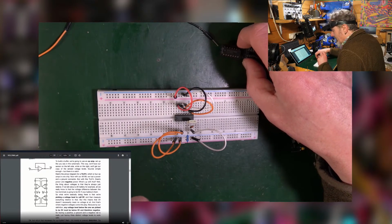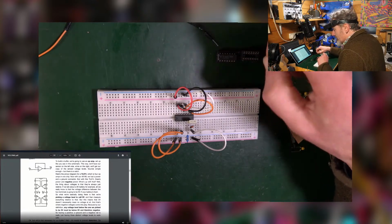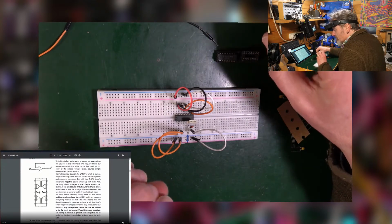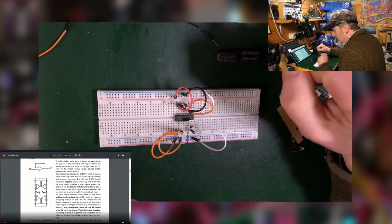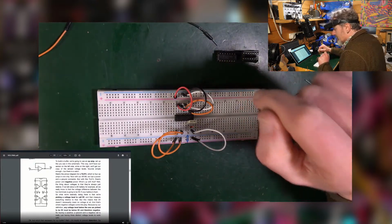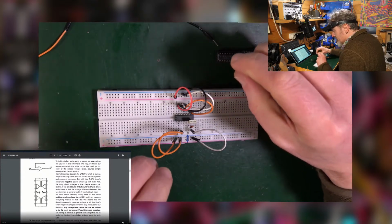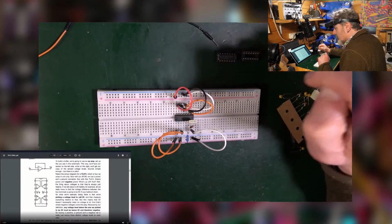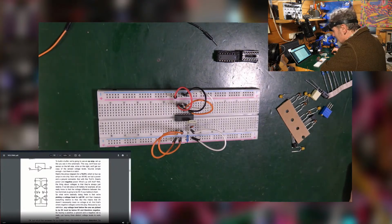So what we're basically doing here is picking a voltage level to call 0 and then measuring everything relative to that. But this means that 0 volts doesn't necessarily mean no voltage at all. And that's where negative voltages come into play. By our definition, any voltage level below the one we've picked to be 0 must be below 0 and therefore negative. Right, okay. So having a positive, a ground and a negative rail is really just having 3 distinct voltage levels to work with. Okay, yeah, interesting.